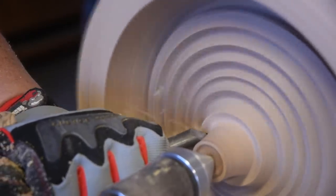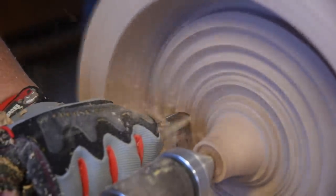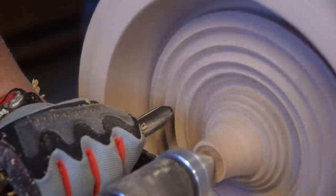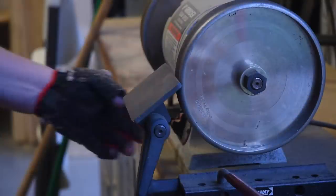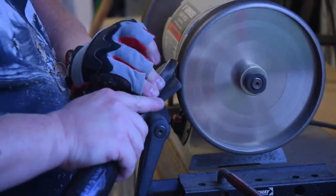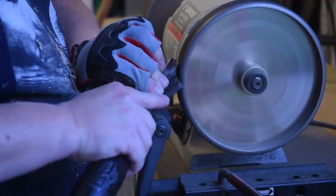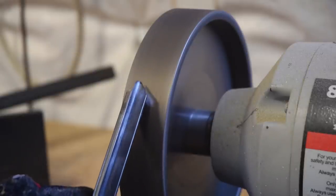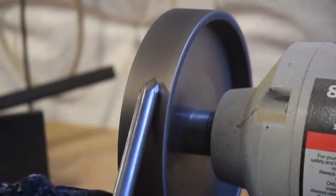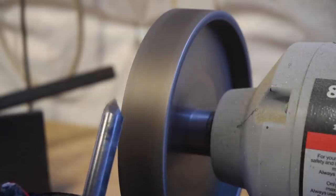See, not as long of ribbons there. And you're seeing a lot more dust. So that tool right there, because I switched to the other side of the blade, now it's cutting a little bit sharp. And I'm not cutting as much material into end grain there, but it does get dull. But you work the wings, both sides, and then you kind of even it up with the nose. And then every three or four times I'll go to the really coarse wheel, and all I'm doing right there is removing the heel to make it easier to turn corners. Just low U's. That's all you do. Draw low U's.